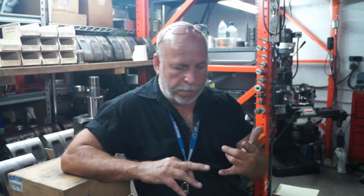Wow. So if you're going to use ceramics on a turbo motor, you basically have to tune it on metal seals until they actually bend and bow and lose compression, preferably a real soft seal. And then at that point, open the engine and switch to a ceramic seal and not touch the map at all. Wow. The problem is that you better have the best of the brand of equipment.